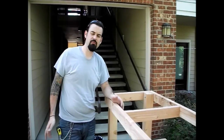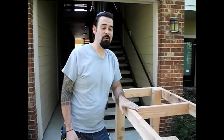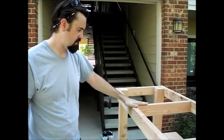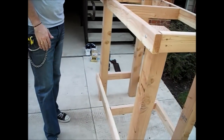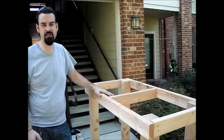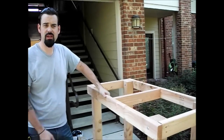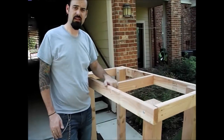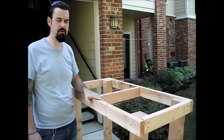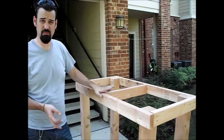The skeleton is built. I'm not a carpenter — this is a hobby project, so don't be too critical, though I do welcome critiques. We've got the top on, the center support in, and the bottom center support in. It's as square as it's going to be. Now we're putting on the actual decking: three-quarter inch plywood for the top work surface, and quarter-inch plywood for the bottom shelf — since we're not doing any loading on the bottom, it's just storage. I've got holes pre-drilled and offset with the quarter-inch wood boring bit so the plywood doesn't split.